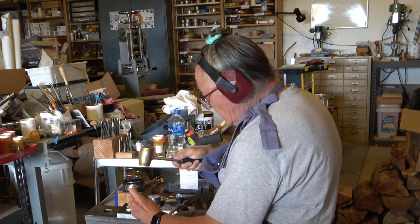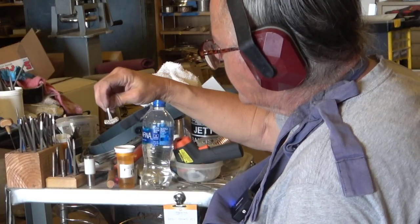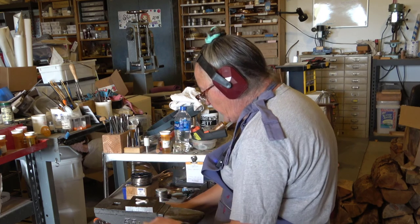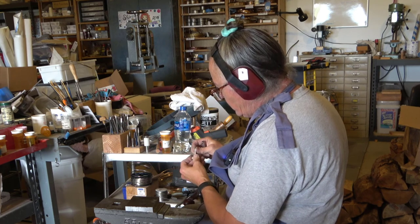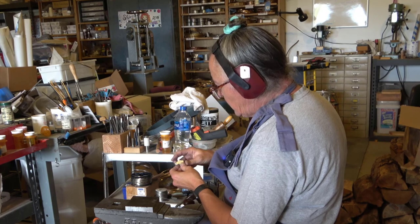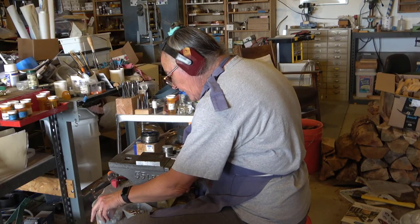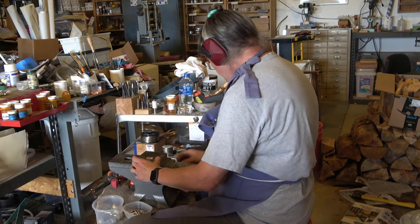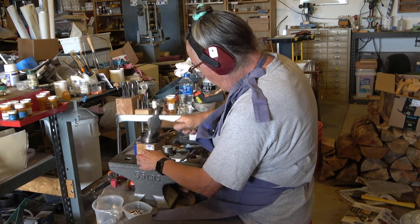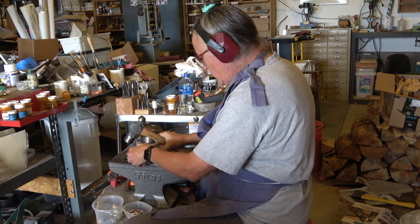This is a very common design — it's a very easy type of punch to make. There we go, and now I have little circles all over there. You can even put one more up here on the handle. There we go, and now that will simply get drilled like all the others. This is another one that's been peened — it hasn't had the flashing taken off on the end, but see, this is one that I peened to create that dappled effect on it. This has a slightly shorter handle. The natural process of casting will produce slight variations, and I'm not concerned about them all being identical because I want to be able to easily make variations on the theme when I'm creating designs.